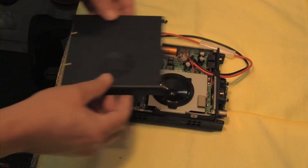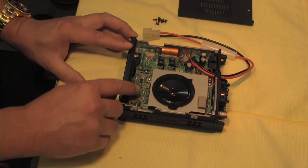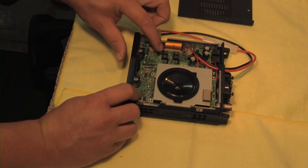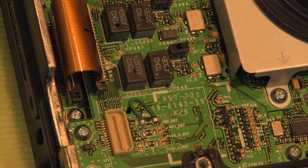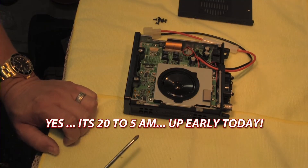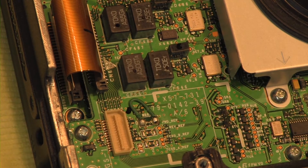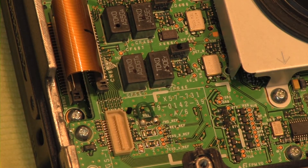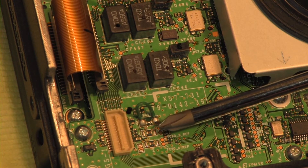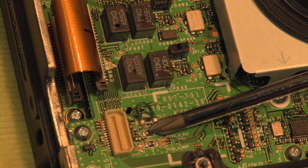Look straight up on the front cover. What we're interested in is basically all in this area right here. You'll see a couple of things going on here. There is a green wire here that's just kind of looped right here — we're going to remove that green wire. And then there's two resistors here, one right here and one right here. We're going to leave the second one alone. We're going to remove this one.